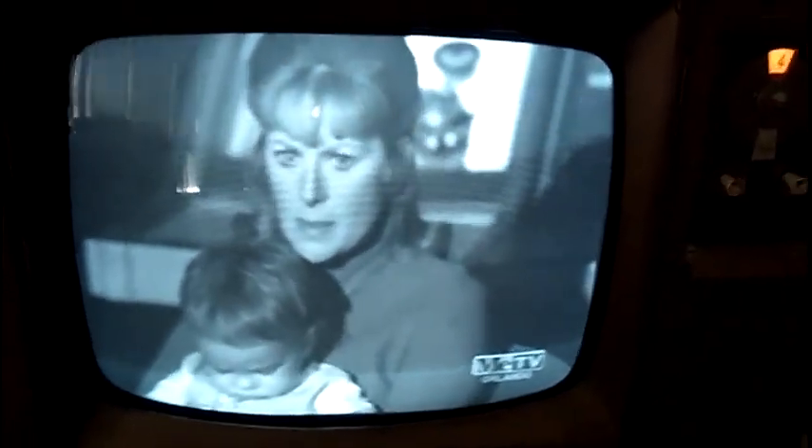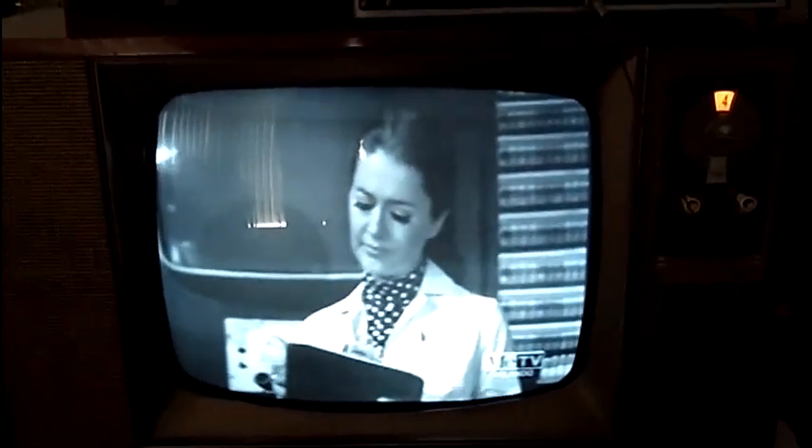I got to thinking that it might have been my BK scanner that simply wasn't making a full sweep of the scan. I tried it one more time and got it as good as I could, leaving the black margins on the top and bottom and getting the linearity as right as I could. I'd have to look into what's going on with the BK — probably put it on a more modern TV I knew worked right to confirm it's linear. Because frankly this picture looks pretty good — good brightness, pretty well lit room, everything looks pretty decent.